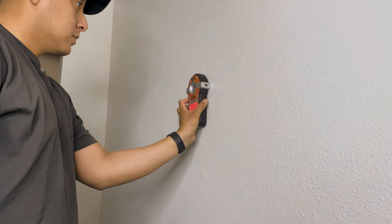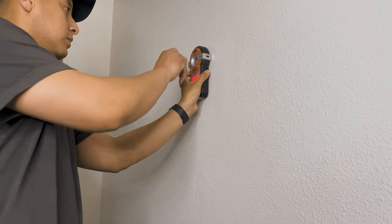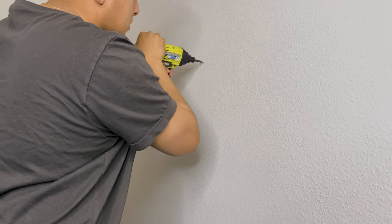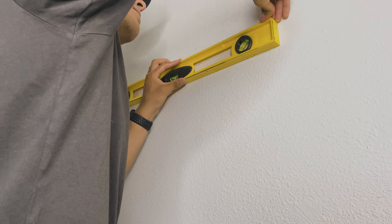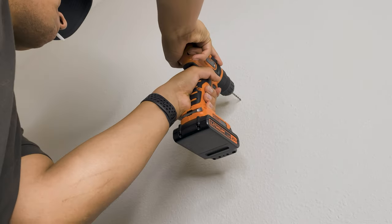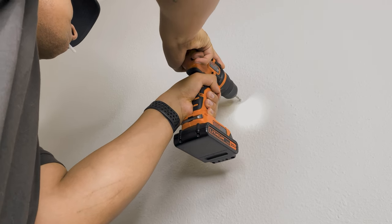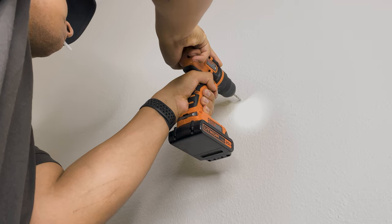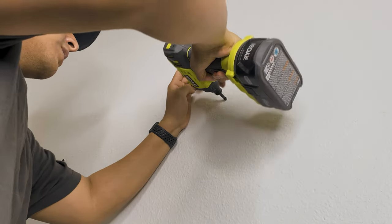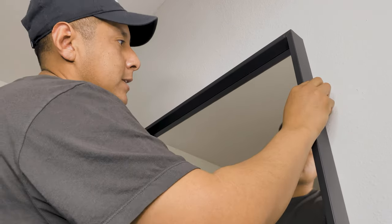It was time to set up the mirror. I used the stud finder so I could securely hang it up. This isn't really necessary as I had drywall anchors that would do the job, but it gave me peace of mind. After using the level ruler to measure the distance for the next screw, it didn't align with a stud so I had to go with a wall anchor. To use a wall anchor, I used the drill to make a hole big enough to hammer the anchor in, then inserted the screw into the anchor.